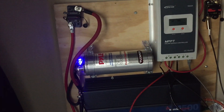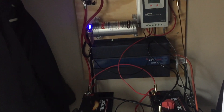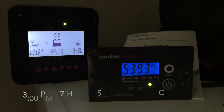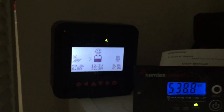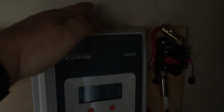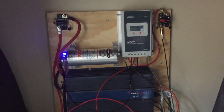This setup is great for an RV, camping, or any other off-grid scenario. In my case this is going to be for an emergency scenario — if a hurricane or bad storm wipes out our power, this will be my backup air conditioning system. It's three o'clock and it's 93 degrees outside, but the battery voltage is still pretty good. After five o'clock we've got 12.4 volts and everything is still humming along, cooling the room. The charge controller fins are still hot, but we've been running the air conditioning from 8 o'clock in the morning until 5 o'clock in the afternoon without stopping.